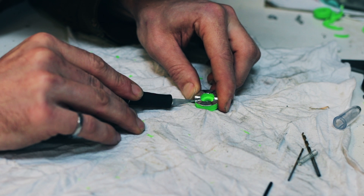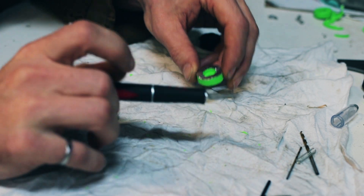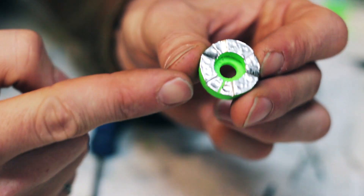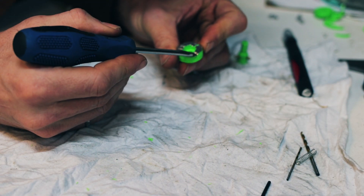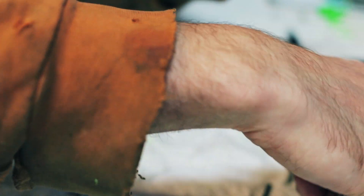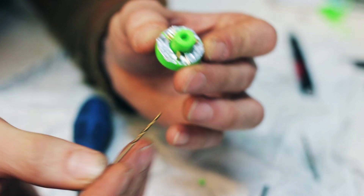So you just cut one, cut two, cut three. Now that it's cut, all you do is push it into the corner. You can see right there that it's split. Go all the way around and do that — push it into the corner like so. The key is that cut in between each of those contacts. Now when I put a ball in each one, it connects — put a ball here and a ball here — and when the post is in there like that, it's going to connect between the balls, which completes the electrical connection.